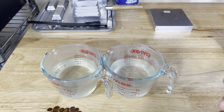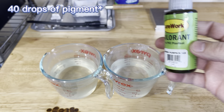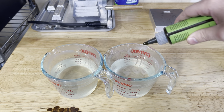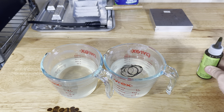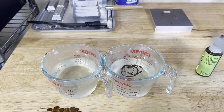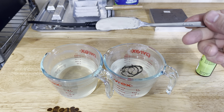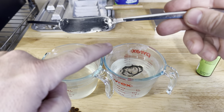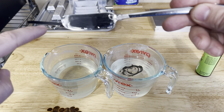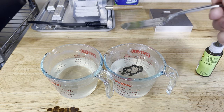We've got one measuring cup of plastic. On most colorants, about 40 drops per cup is average, but we're not really going to measure out drops — we're just going to pour some in, stir it up, and see what it looks like. We're using cheese spreaders you can find on Amazon. I used a butter knife for the longest time, but the bottom side of these is smooth, whereas a butter knife is serrated and will cause bubbles. These work a lot better.